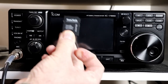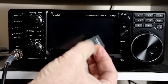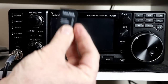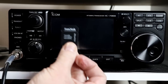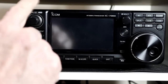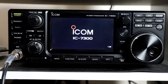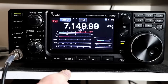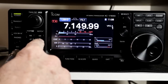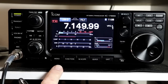So we have our SD card — mine is actually an SD card adapter because I've got a little micro SD card, but the radio doesn't know the difference. That's a full-size SD card or a micro card in an adapter; either works fine. So we have placed our file with the update on the card. We're going to put it in the radio with the radio off. Now it's in there, we'll turn on the radio. I'm going to turn up the volume and the squelch so that you can hear the beeps as I'm going through the menu items.